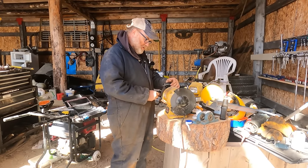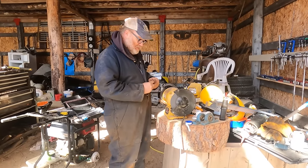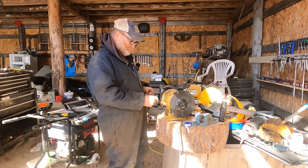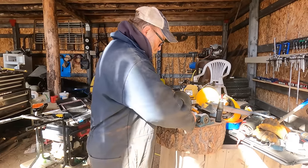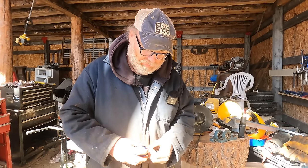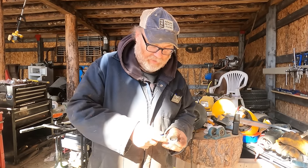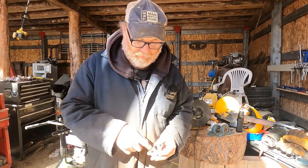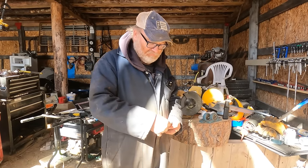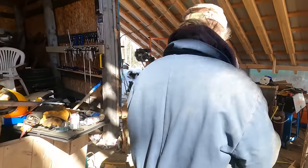I used to get them lots when I was younger. Yeah, I didn't even know I had an arc flash this morning. I woke up and it felt like I had something stuck in my eye. I had no idea until you mentioned it that it was an arc flash. Yeah, feels like a bit of sand in your eye. That's exactly what it feels like. I couldn't find anything. And it's either one blister or a lot of blisters, and they usually show up about 12 hours after getting an arc flash. I've had them last 12 hours. I've had them go away in about 6 hours.